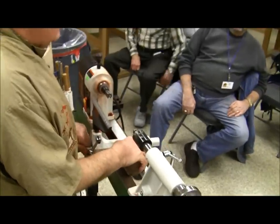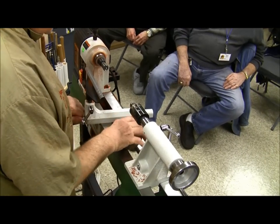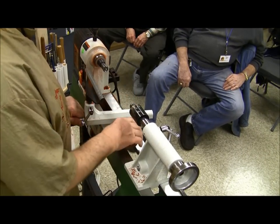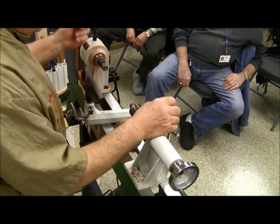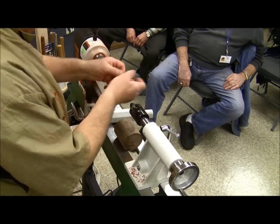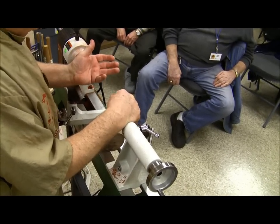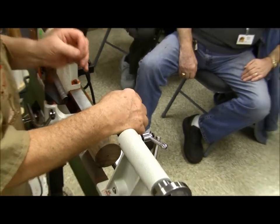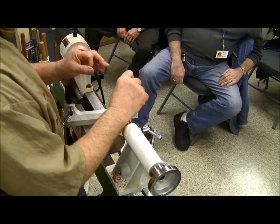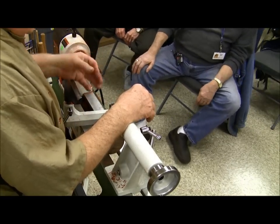While I was on break I was asked why not use a rag. The reason is a rag has long continuous fibers in it, and those fibers will catch in the spinning wood and grab it and wrap up around in there so fast with your fingers in it that you won't believe it. But a paper towel has short little wood fibers in it and they will break and tear off and not grab.